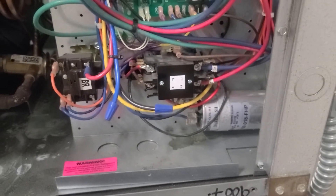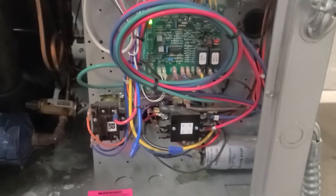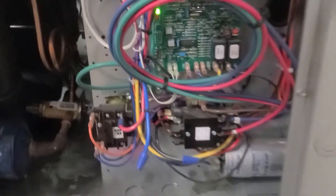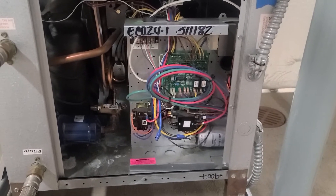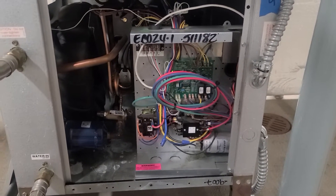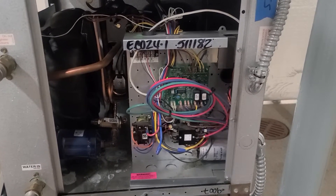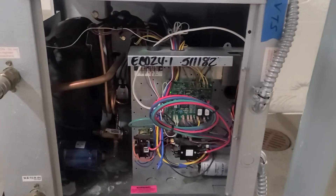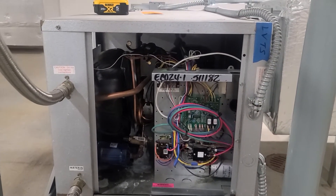I tested the capacitance and my readings were off, so I'll definitely be writing that up. That's the one that goes to the compressor right back here. I have some that are three-phase which don't have capacitors, but I've found a couple of these across about 13 or 14 heads I've been looking at so far. This is definitely one where the capacitor is leaking.